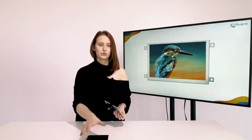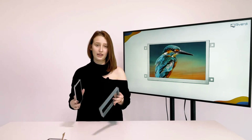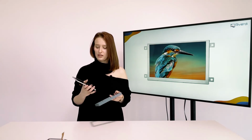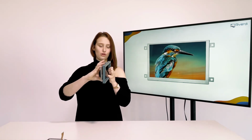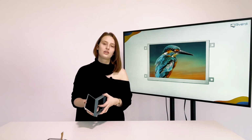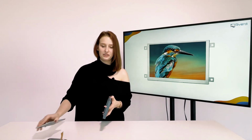If you're aiming for a high IP rate and choose the mounting brackets, so mounting from the back, please remember that sealing is up to you in this case. A great idea would be to apply a one-sided gasket, so when assembling, you can push the module onto the gasket. Why one-sided? The service is easier, so you can easily disassemble without damaging it. If you don't mind damage, you can use some glue or silicone. That will be perfect sealing as well.